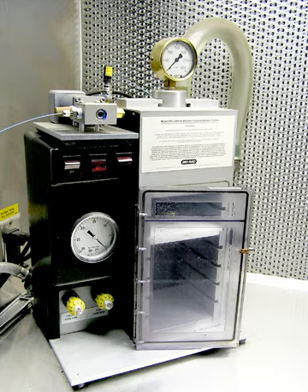Later the design was refined by removing the surge tank and changing to non-explosive propellants. DuPont added a plastic extrusion to the exterior to visually improve the machine for mass production to the scientific community. Biorad contracted with DuPont to manufacture and distribute the device. Improvements include the use of helium propellant and a multi-disc collision delivery mechanism. Other heavy metals such as gold and silver are also used. Gold may be favored because it has better uniformity than tungsten, and tungsten can be toxic to cells, but its use may be limited due to availability and cost.